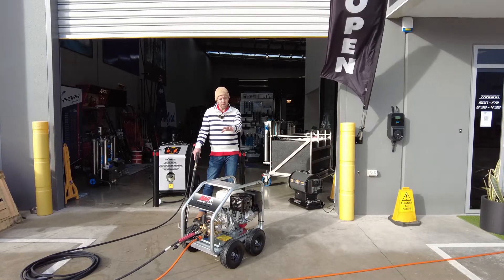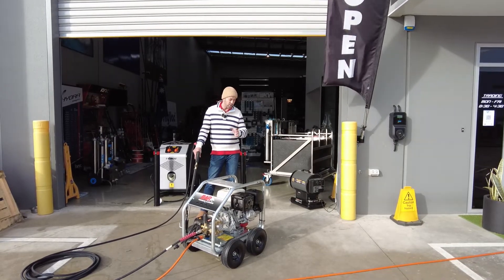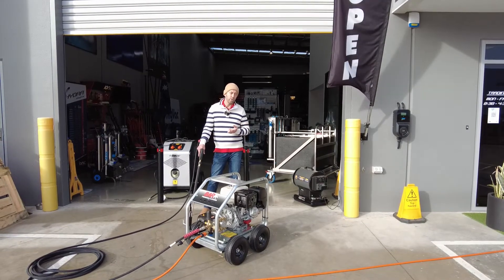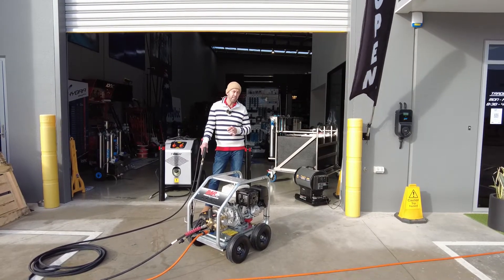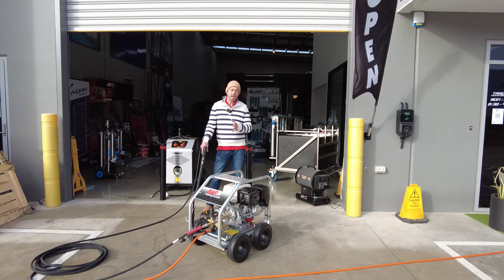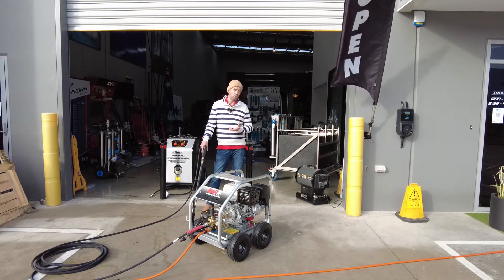It does have a bit of weight in it. We can put a hose reel on top, whether that's a 30 or 60 metre hose reel. But this particular system is powered by the new generation Honda IGX 390. If you haven't seen those engines before, they're vastly different to previous Honda models — they auto-govern. They're set up to pressure-sense, so the engine RPM will drop back to idle when we're not under load. If we release the trigger, after a short delay the engine drops back to idle.